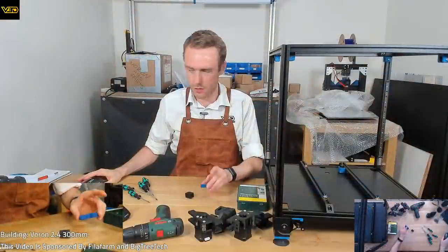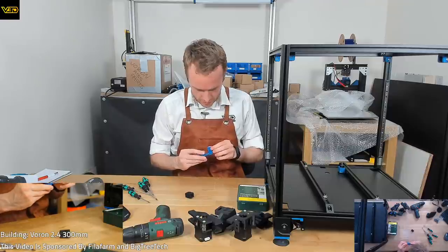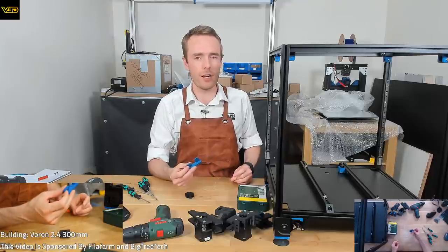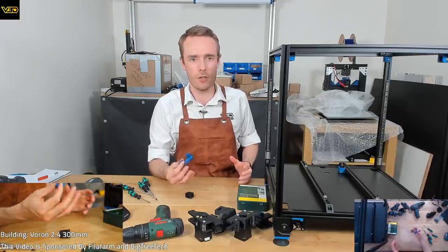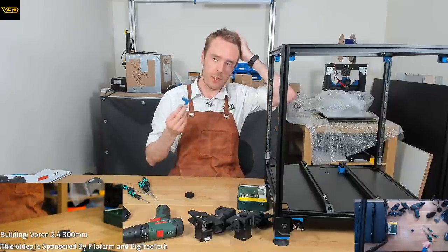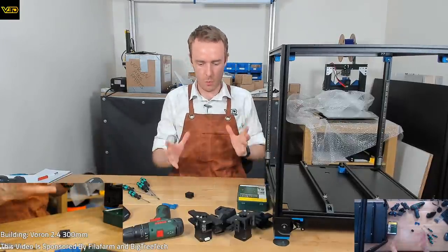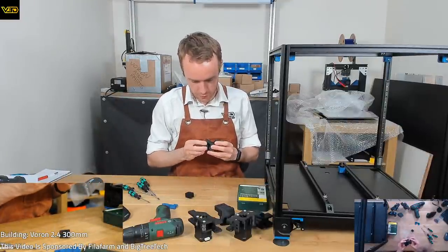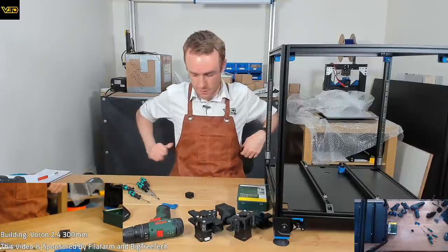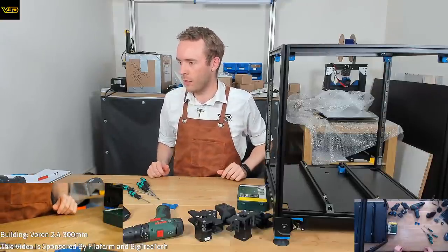These Endstop PCBs, I believe, are part of the user mods program group thing. And I've always had problems with user mods in that obviously they can add some great functionality. Lots of people have lots of fantastic ideas, and it is really nice that lots of people contribute. But sometimes, or quite often, those are people who have not got the experience to get the tolerances and stuff on parts optimal for lots of people to print them. It's all right that one off, they may print okay for just you or for a few people. But when you're printing on large scale and off lots of different printers, you need to be aware of how your assembly tolerances are going to stack up so that you can make sure that not just one fits, but all of them fit. We'll see how we get on.